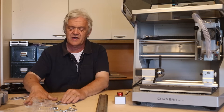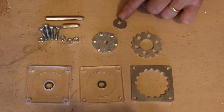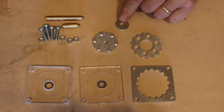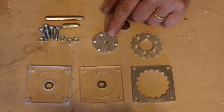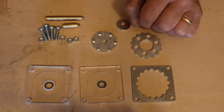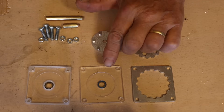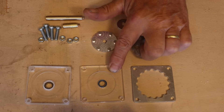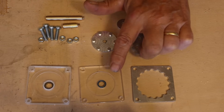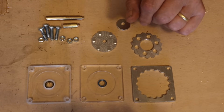Here are the parts I came up with. The main inner ring, the drive ring, and the eccentric were milled out of 3mm aluminium plate. The main drive output was 5mm aluminium, and it got a pretty milled pattern on it. We also have two axles out of brass and some bought bolts. I was going to do the two end plates out of metal, until I decided they'd look really pretty if you could see through them — so I did those out of acrylic: 5mm and 10mm.